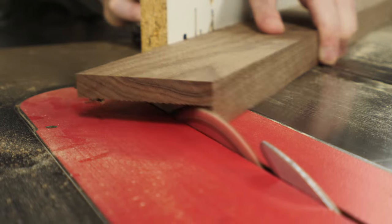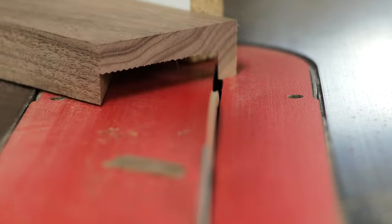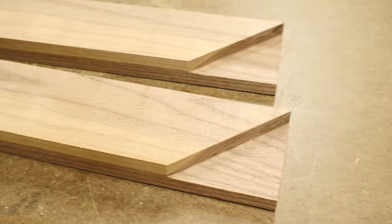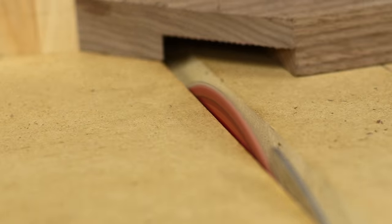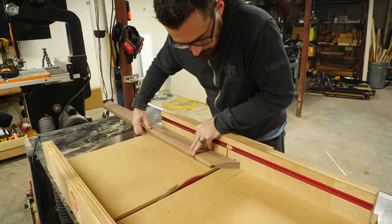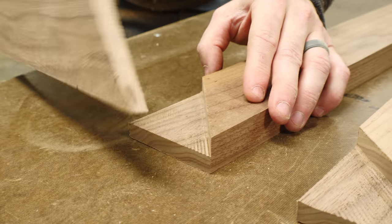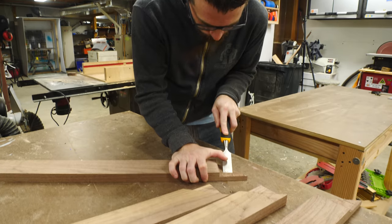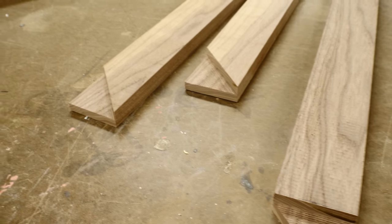You could use a dado stack to make this go faster, but I used a regular blade and just made lots of passes to chew away the section. I did this on one end of all the pieces before flipping the miter gauge around and doing all the other ends. That finished up all the 45-degree cuts. The rest were cuts on pieces that were already mitered on the end. I was using the crosscut sled so I had to raise the blade to account for the difference in height. I cut away half of the thickness on the rest of these corners so they could fit into the previously cut pieces. I'd never done this joint before so I was a little nervous, but it turned out really, really nice. After I got one finished completely, I just did the same process to the rest of the ends. After all the cuts were finished, I used a wide chisel to flatten out where all the blade marks were — quick and easy, but it made for a much tighter fit.